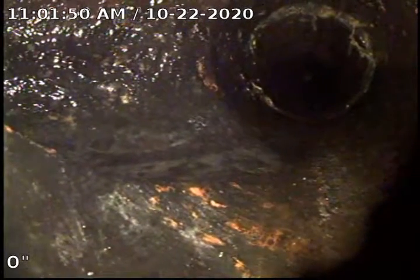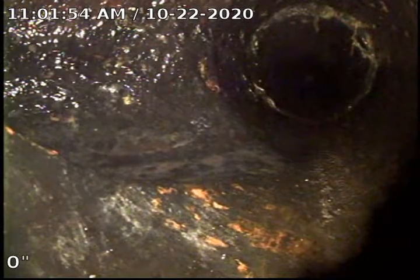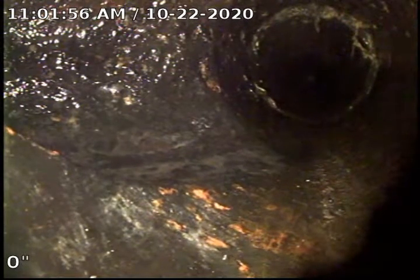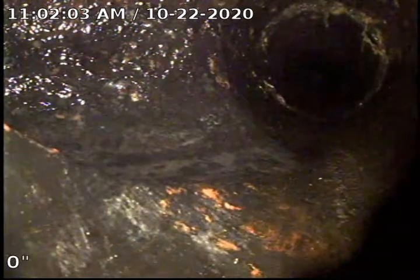Okay, the Y you see here, this is what picks up the bathroom. It's the bathroom group that goes through the wall on the north side of the house. It runs under the breezeway and comes out. There's also a second line that comes out the front of the house that picks up the storm and the kitchen.